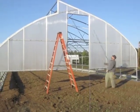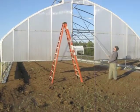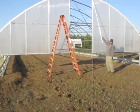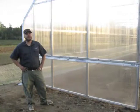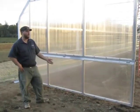The only thing that was left was to go through, put our sheets above our peak vents, and also put them below our peak vents. There are situations where you can use 2 little pieces of single H channel overlapped as opposed to double H channel. We're putting the finishing touches on our 30-foot wide metal end wall for a movable structure with flip-up bottoms.